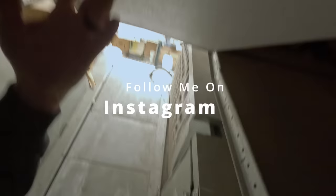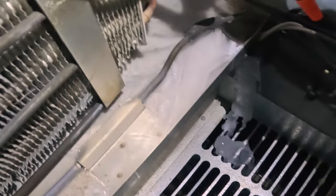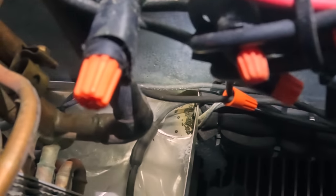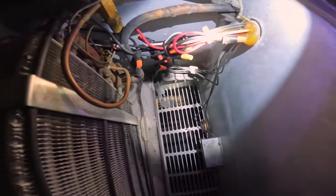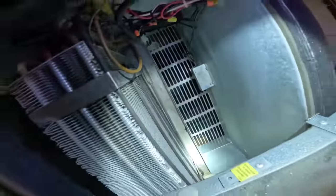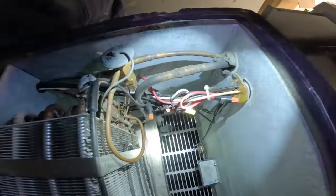We're up here above the ceiling — that's massive. Here is the ice that we've got going on. See the icicle there? So I've got an accumulation of ice here in this drain pan. You can see there's water right there, so the heat tape is working a little bit, but for whatever reason it's dripping down and getting that stalactite of ice. We're going to put this thing into a defrost and see if we can find out where it's dripping.